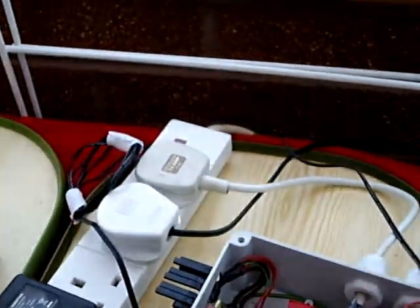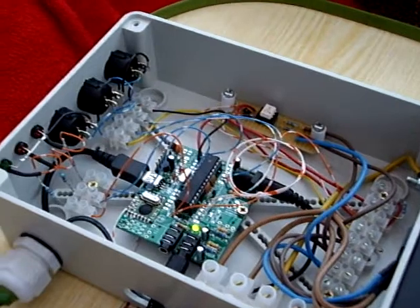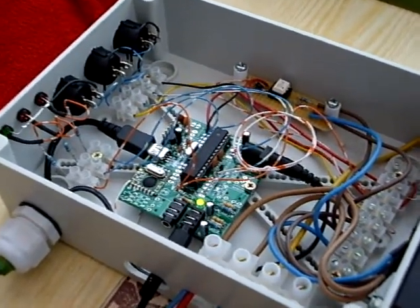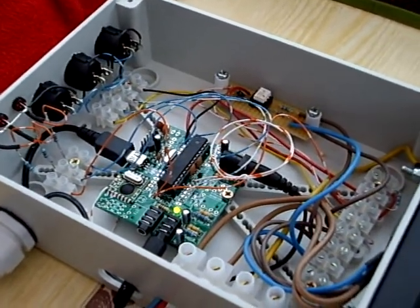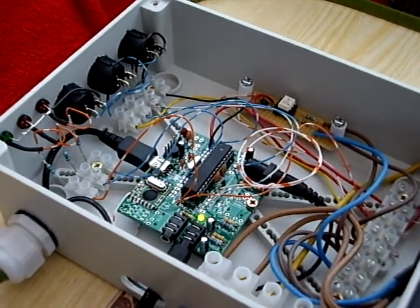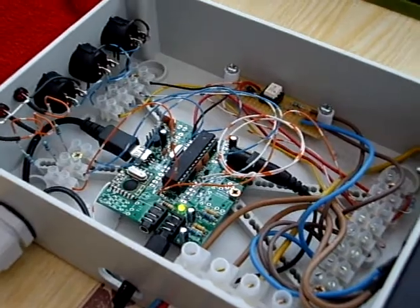The two rigs that I'm checking — this is a standard EmonTX rig that I've got set up which has got the independent voltage references, each of them with a pair of 470K resistors. So the V-Refs do get pulled around a little bit by their respective coils, but they are independent so there seems to be no overall problem there.